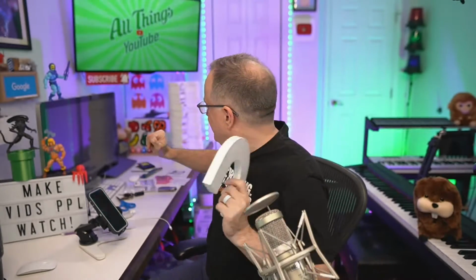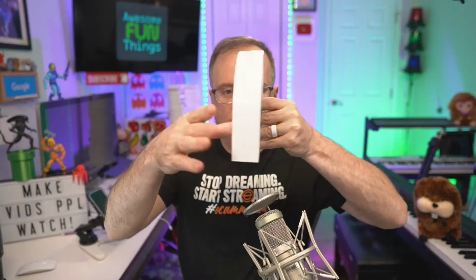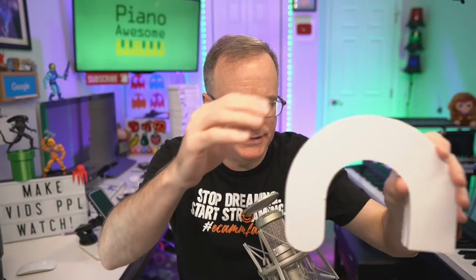And I made a mistake, because when I painted these, I clamped them all together. So I had a huge stack of them, and then I just painted the edges. Well, when it dried, they wouldn't come apart. It glued them together. So I had to really work at separating all of these things, because painting all the edges at one time would save time, but the paint acted like glue, and it was quite the mess. So lesson learned there. And I drilled 2 holes in the bottom to accept the metal rods, and that's all I got. So I got all the wood cut, I got all the wood painted white, and I drilled the holes in the bottom for the metal stakes, and that's it.